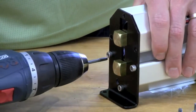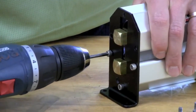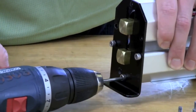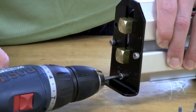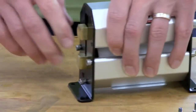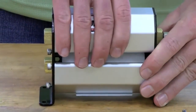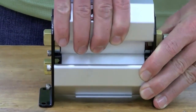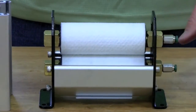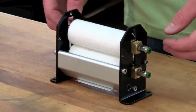To make the removal of the upper extrusion easier, it is recommended that you loosen the socket head cap screws that hold the lower extrusion in place. You do not need to loosen the bolts on both ends of the unit, just the three bolts on one end. Loosen the lower bolts a couple of revolutions, but it is not necessary to remove them completely. You should now be able to grab hold of the upper extrusion and pull it up from between the end plates. Be careful not to knock the flat springs loose that are installed on the inside of the upper extrusion.